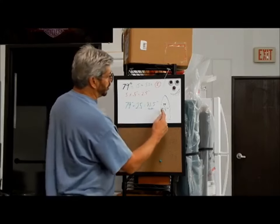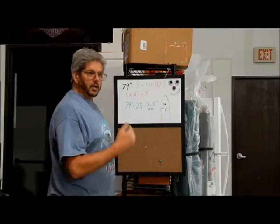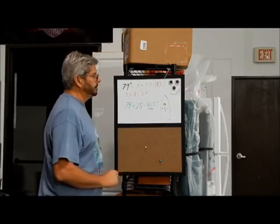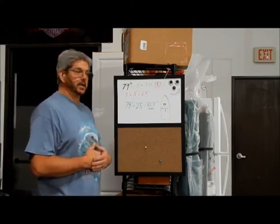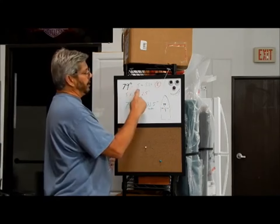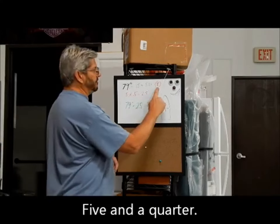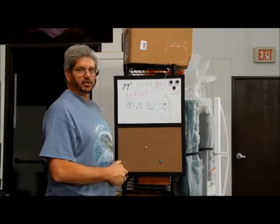So the first thing we need to know is from deck mount to deck mount. Not the beam of the boat, deck mount to deck mount. For my Baja boat here, it's 79 inches. So I need to know how many 15 inches are in that 79 inches. If you go 79 divided by 15, equals 5 1/4, roughly. We're going to round it to say 5. So there are 5 15 inches going across the boat.